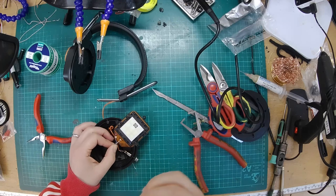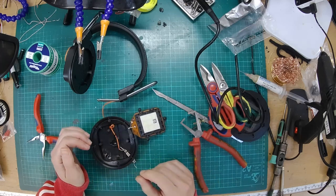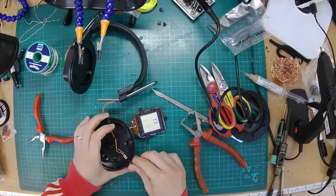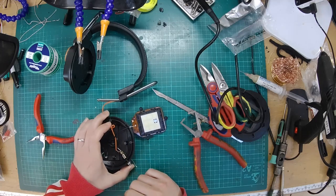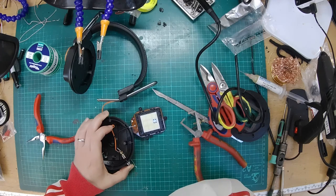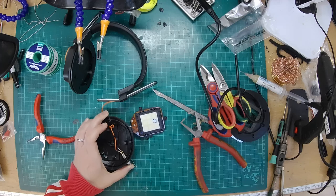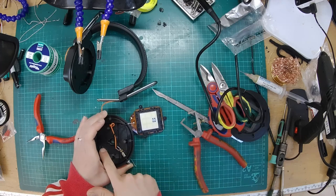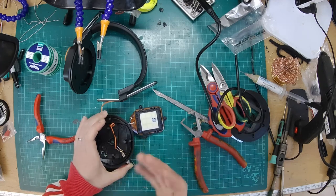So that's the wires attached to the driver again. And then after we've done this, we've got to make it a balanced cable, but we won't bother going through that. But I'll show you what it looks like at the end. Just waiting for the hot glue gun to heat up. So that's pretty straightforward. You know, we've drilled a hole, we've soldered on a couple of wires. It's not that hard. So converting these to balance isn't bad, and also replacing the socket that's in there is probably a good idea anyway, because they tend to be a little bit iffy anyway.